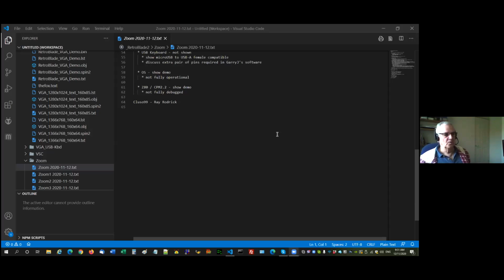I'm not sure whether I'm going to be able to do all the ones with the flash chips though, because I only have one 8 meg flash chip that'll go on it. Most of Peter's are WSONs, and I'm not comfortable with putting a WSON package on it because I've got to put a wire on the board. I didn't connect it in my rush to shove this on the board at the last minute. You know what happens in rushes, you forget something, and I didn't check the specs. It requires hold and write protect to be pulled high or driven high, and I don't have connections on those two pins, so I've got to put a wire across the top of the chip. Yeah, Murphy was around, and EPROMs don't require it. They've got internal pull-ups. Well, it looks like the flash chips didn't put the internal pull-ups in.